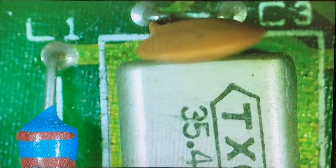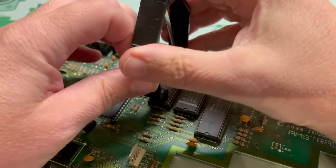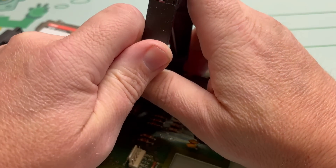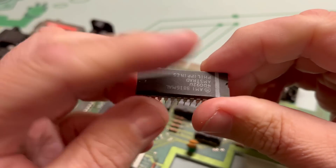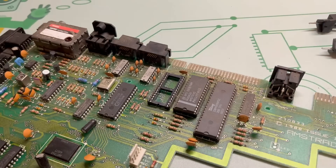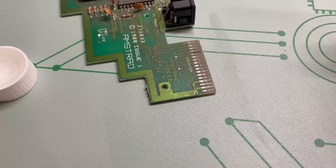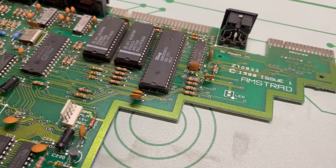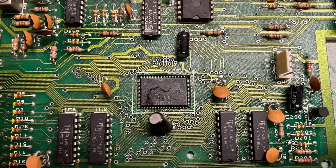Looking around the rest of the mainboard under the microscope does reveal that the whole thing is covered in awfulness that may be invisible to the naked eye, but could be harbouring all sorts of nasty things. So I guess we should give the whole board a clean while we're here and reseat all of the ICs as well. Some of these 30-plus year old chips were hanging on for dear life, and we need to be really careful not to yank them out too roughly or we might bend or break legs, or worse still, break the chips themselves. These ROMs look in good condition, but I may swap them out for a diagnostic ROM if after this little clean up we're not getting anywhere. After a good clean the board is looking much more healthy, and I'm happy to say that after getting that bit of detritus out of the 40077 gate array, we're not getting a short on the Z80 data lines either. So let's plug back in and see what we get.